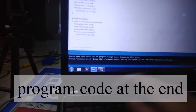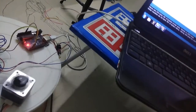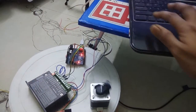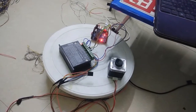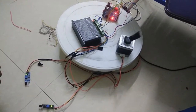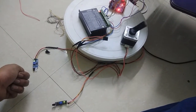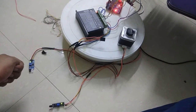In the programming I have set different speeds for clockwise and anticlockwise motion. So if I put my hand in front of one sensor it will rotate in the opposite direction and the speed changes, and if I put my hand in front of the other sensor the rotation changes again along with the speed. This is just to show that the detector setup can actually detect obstacles — here my hand represents the obstacle. So yes, it can switch over from clockwise to anticlockwise and also switch between different speeds. You can also finally adjust the speed with the potentiometer.